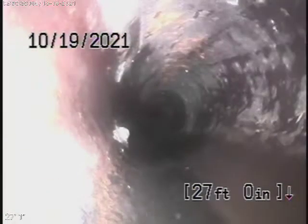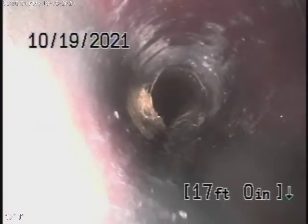There's a little bit of roots coming into the pipe, which is very common. The pipe still appears to be in fair condition. A little bit of roots coming in — these roots can be easily cleaned out. Probably the best approach is to clean it with a cable with a blade. Stay away from a hydro-jetter, especially through the old cast iron pipe. The best way to clean this line would be with a rotor-root machine — that's what I would recommend.